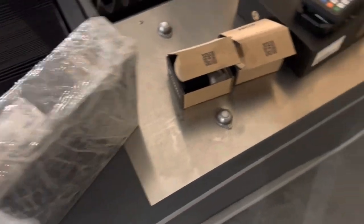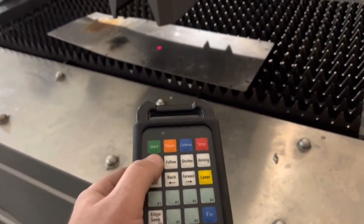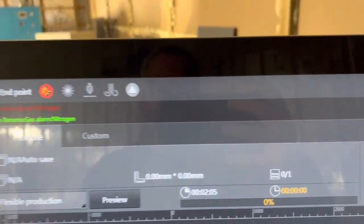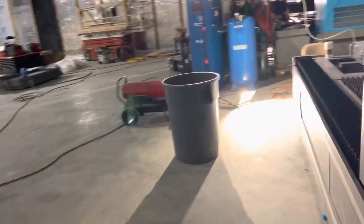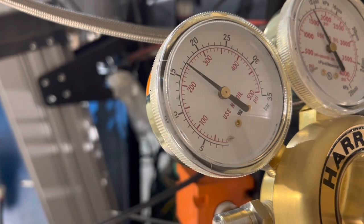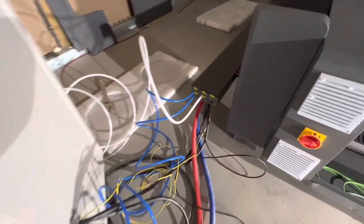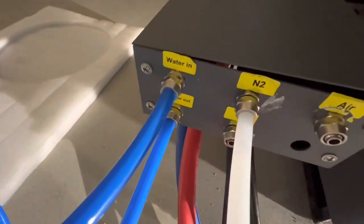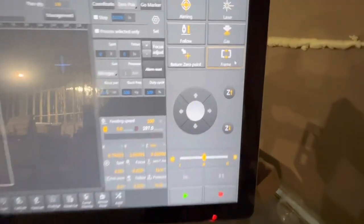One of the reasons I chose these guys to build these machines is they are very responsive and helpful after the fact, and we're working to solve all these issues for future builds so installs go very smooth. Here's another one I've seen before: the low gas alarm detection threshold was not set properly at the factory, so it was immediately alarming when trying to purge the air. These guys actually have a nitrogen generator, which is very cool. A pretty simple adjustment — something that should be caught in factory testing — but a quick solution. Solve it and move on.